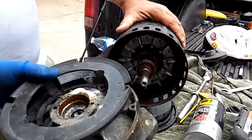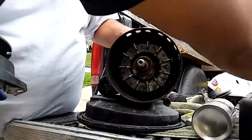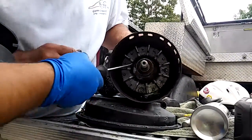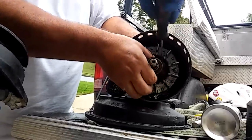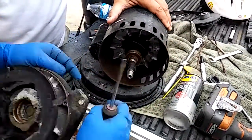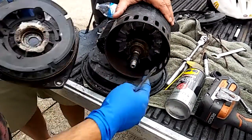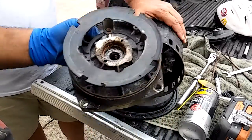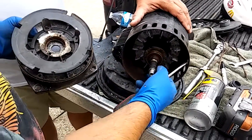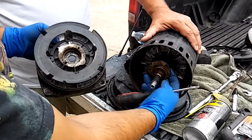The reason you want to take these screws out is because there's a plate on the back — that's what the sandwich is. You can see how much rust is in there, and that is why it's imperative that you put a lot of lubricant in there.